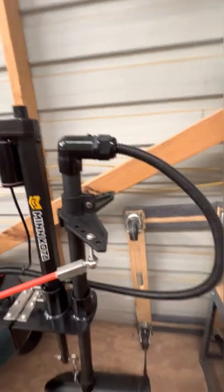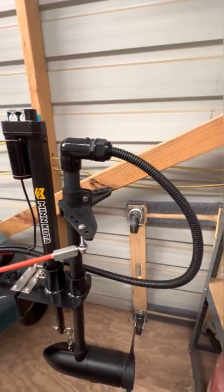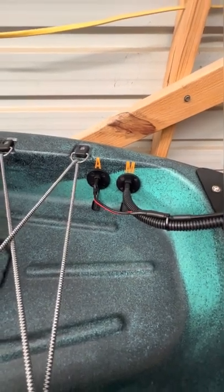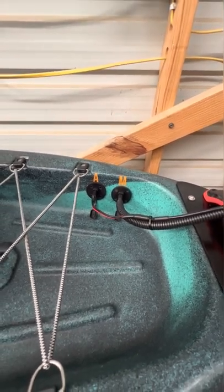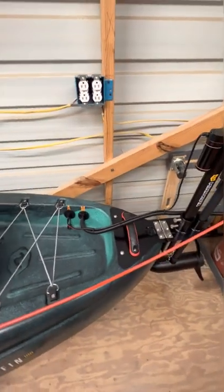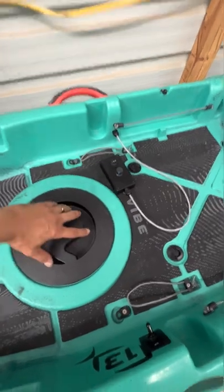I got a three-quarter-inch threaded gland nut to take the positive and negative wires from my trolling motor and ran it back to a waterproof SAE outlet — one for the motor and one for the actuator. The actuator SAE outlet is 16-gauge and the trolling motor outlet is 10-gauge, so all my trolling motor wiring is 10-gauge. Both of those outlets run back to the pulse width modulator that I created in here.